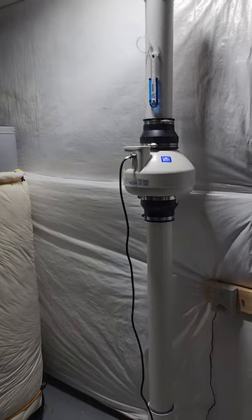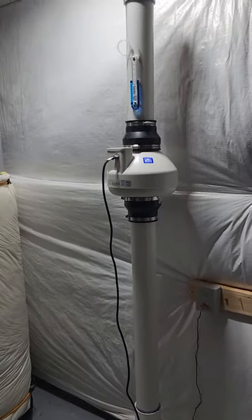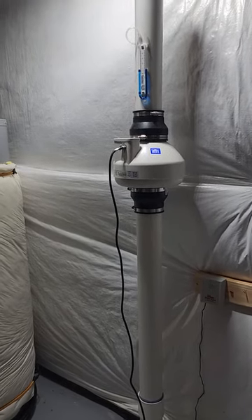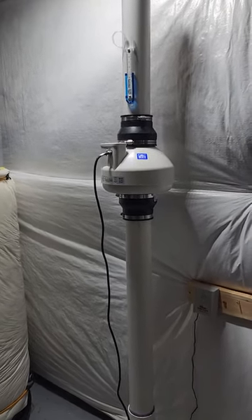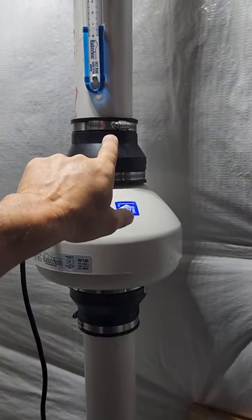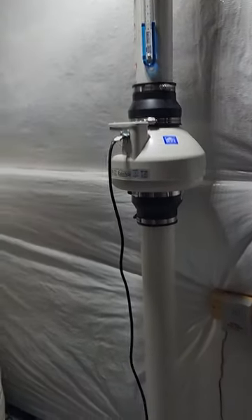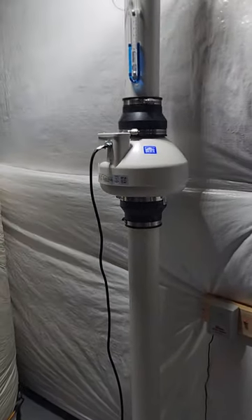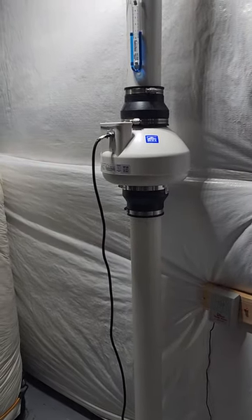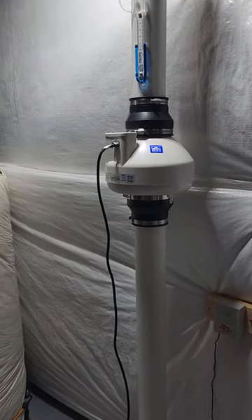What I'm going to have to do is recommend that fan get installed at an exterior location. Attic is acceptable. But the problem is if it's in the basement, these grommets go bad, these bands loosen up and open up — you're going to have about five to eight, possibly ten times the amount of radon levels you normally would have. It's more harmful to the occupant.